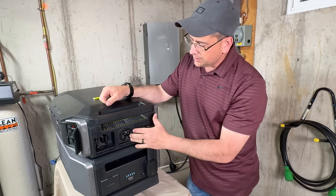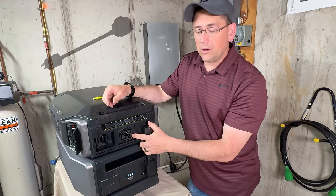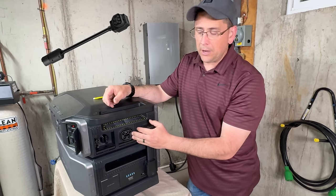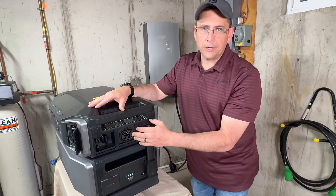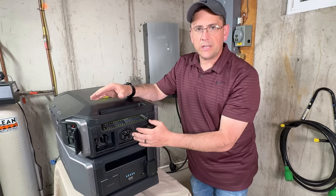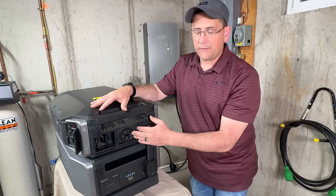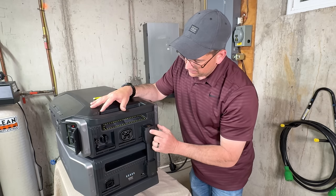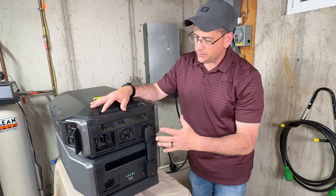You can also get that out of the front plug, but this is just so simple — plug it in and the switch kicks over. This is also capable of doing EV charging; you can pick up a dongle that allows you to charge this with EV charging stations. They also have a dongle for generators which will allow you to get the fastest charging possible. This can be charged with pretty much any regular generator that has a total harmonic distortion of less than 10% — most home standby generators from Generac are right around 5%. The battery stacking works the same way down, opening this port and sliding in the next battery — you can have a total of five batteries stacked.